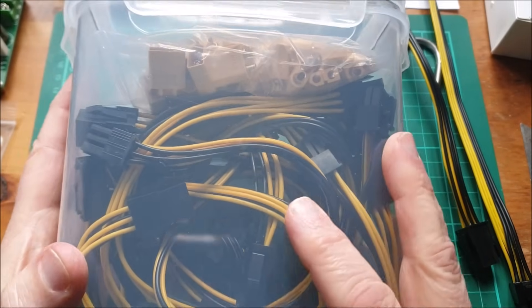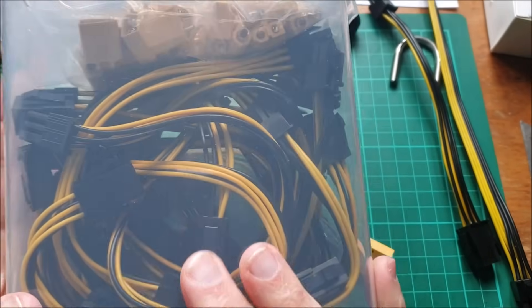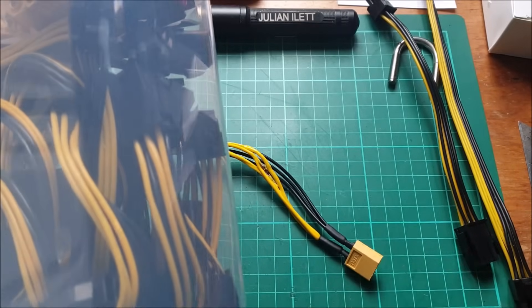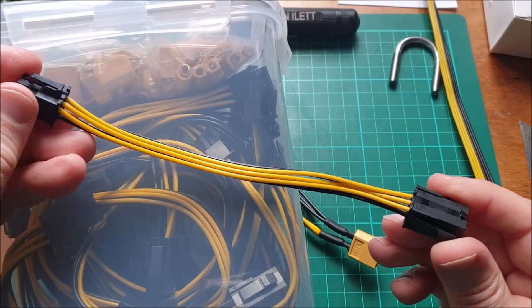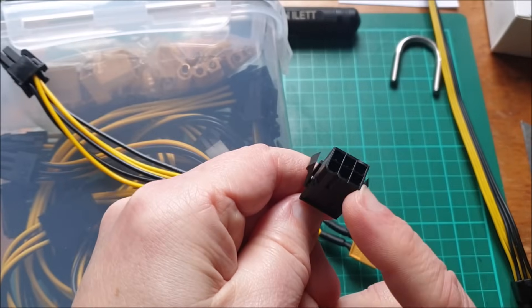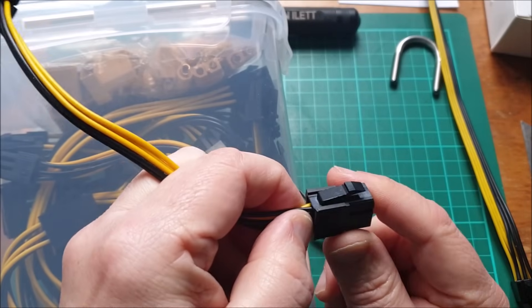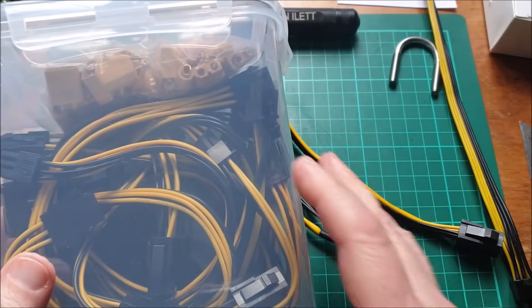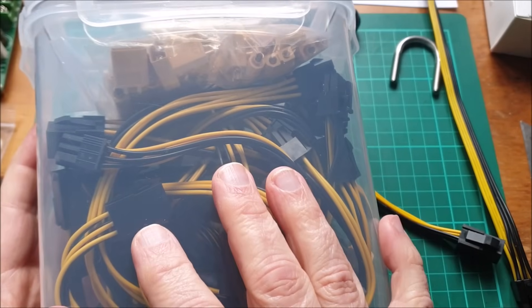The thing is I've bought lots of these cables — I think there are 25 in here — and these cables are reverse polarity from my point of view. What I'm doing is just cutting off the socket. I don't know quite why you'd want a short extension lead like that, there must be a use for it, but cutting that off and putting an XT60 on. I've got lots of these and lots of XT60s ready to make these up.